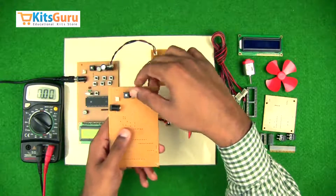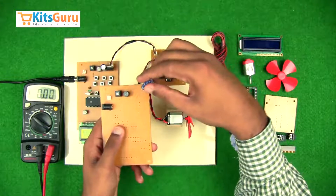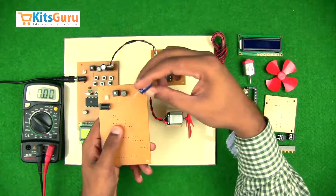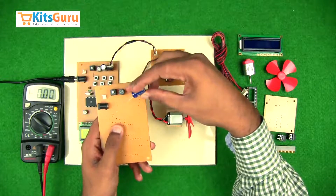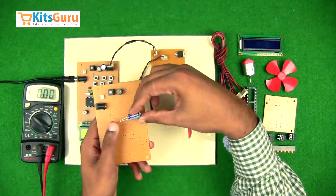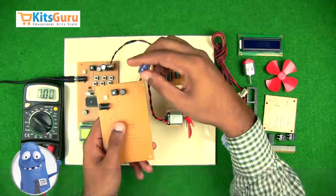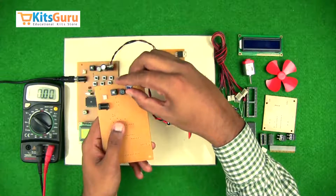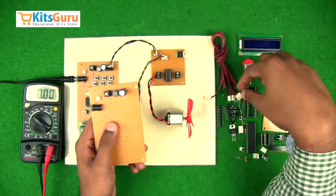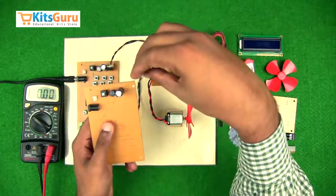To remove all the AC ripples produced during the rectification process and to convert pulsating DC into smooth DC, we attach a 1000 microfarad capacitor. This capacitor also has polarity — the longer stem is the positive terminal. If both stems are of equal length, there will be a blue strip with a negative indication, telling us which is the negative terminal. While inserting the capacitor, ensure the negative terminal is facing you so the positive terminal of the capacitor aligns with the positive terminal of the bridge rectifier. Then a two-pin connector is added to give a parallel power supply to this PCB.